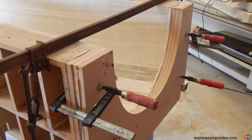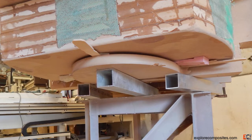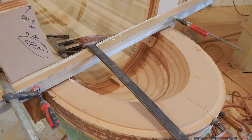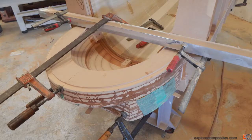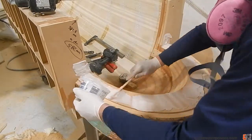The bulkheads were held in with screws and glue. This is the one in the back that has a little more shape to it, and it's glued on. Moving around to the front, I set up that bottom block — which forms the nose piece — on some shims and put some glue in there. Once it's glued on the bottom will be unsupported, so I'm using small blocks with screws bridging the joint, with packing tape on them and a bunch of clamps in different orientations to hold it right where I want it until the glue cures. This is a key piece — if it's misaligned, everything else is hard to deal with later.